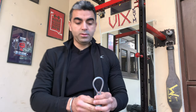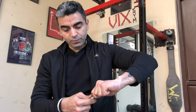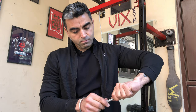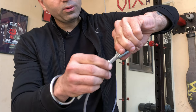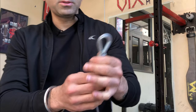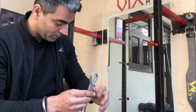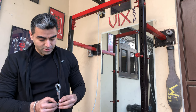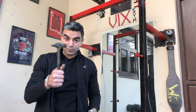When you have made the hook, put the thimble here and tighten your rope around it. Now the thimble is in place — hold and pull the lock up so the thimble is locked in. I need to secure both locks, but since I don't have a crimper tool, I'll have to hammer them to stay in place.